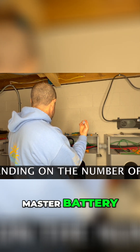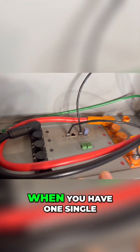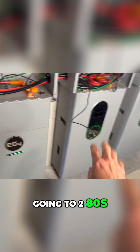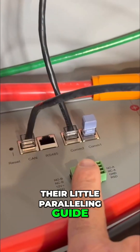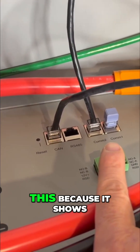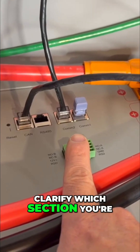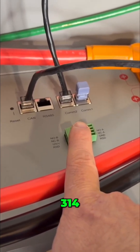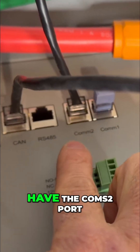Because the 314 is the master battery, it gets this jumper. When you have one single 314 amp hour battery going to 280s, the termination resistor and cables run in a specific direction. Their paralleling guide — which I'll link in the description — isn't entirely clear on this, as it shows two different illustrations without clarifying which applies to which scenario. If you have one single 314 and then 280s down the line, put the termination resistor in the COMM 1 port, with the COMM 2 port feeding from the 314 over to the first 280.